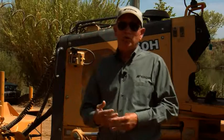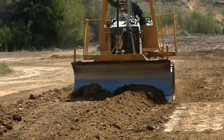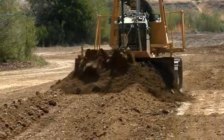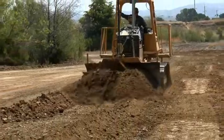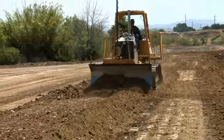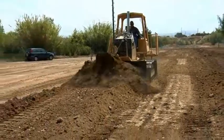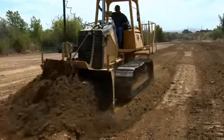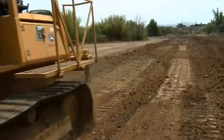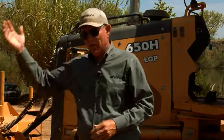The last aspect is that when that machine lands on the job site, that site isn't smooth. The reason you've got a dozer there is because the existing natural ground is rough and bumpy. So how does 3DMC squared perform when you're trying to cut a smooth surface, but the machine itself is riding on very undulating surfaces? That is a great demo right there. You can do that a couple of ways. If you have created a non-planar surface, you can cut that back off again to show how you can go over a rough surface and make it nice and smooth. If you don't have that surface, simply take a smooth surface and manually dig some moguls, tear the thing apart so you can see some variations, and then take 3DMC squared over it, and that is when the contractor really sees how the system works.